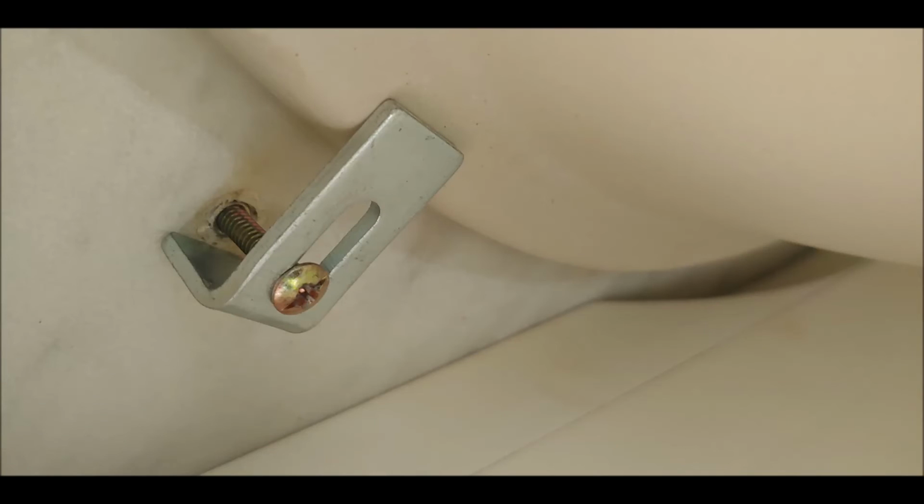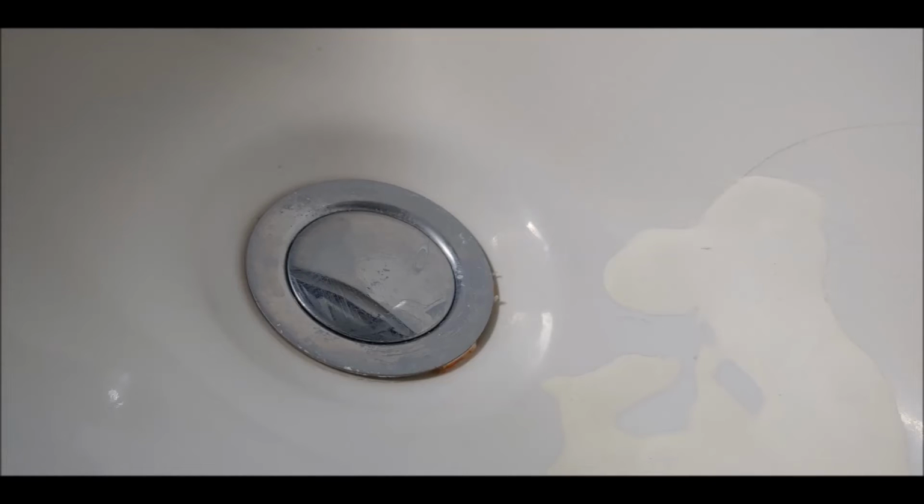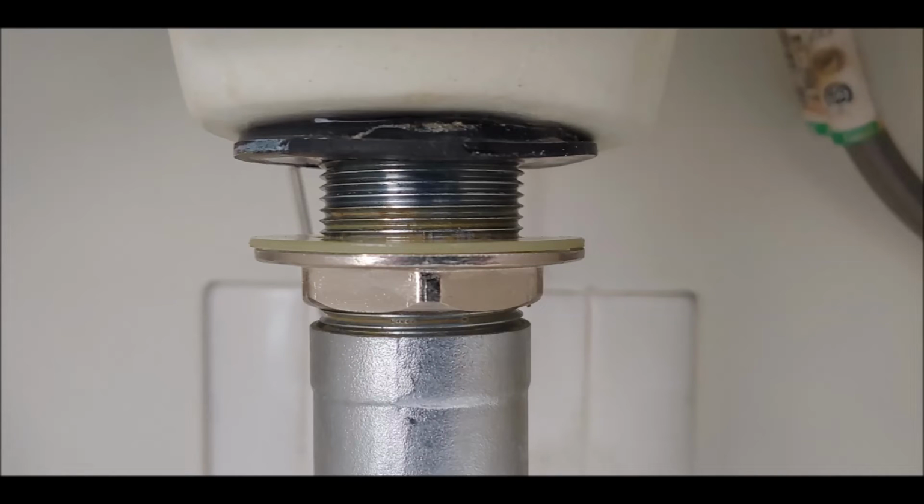So after that, I loosen the 4 brackets under the undermount, and I don't remove the brackets, I simply loosen them. Now, even after loosening the brackets and twisting them out of the way, you have to take out the drain. So what you're going to do here is basically loosen the drain. There's usually a nut at the bottom here, and you're just going to loosen that. And once you loosen that, everything just comes apart.